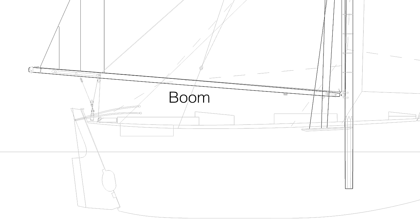Now that Bob has fastened the gooseneck bands to the mast and they look fantastic, it's time to hang a boom. Tally Ho's boom was built by Robert and Doug and their team. The purpose of the boom is to control the main sail — the front of the boom is attached to the mast, and the back is attached to the boat with a sheet, which is a line that goes between the end of the boom and the horse or jibe buffer on the deck. That line controls the angle of the boom and the sheeting position of the sail.